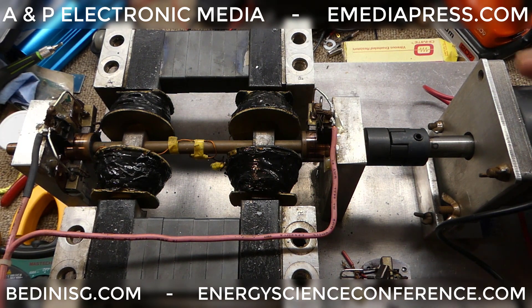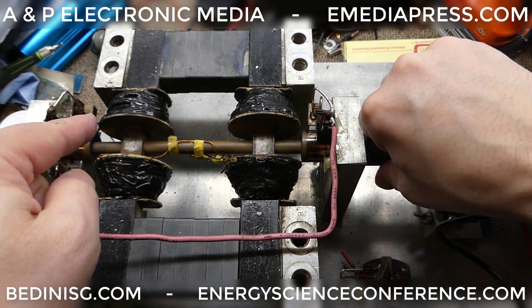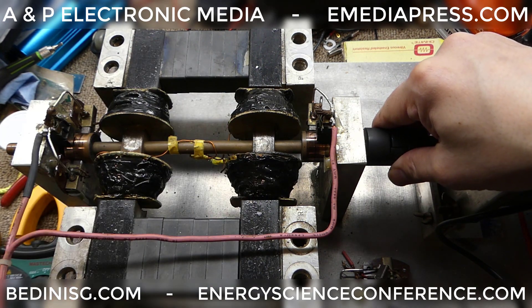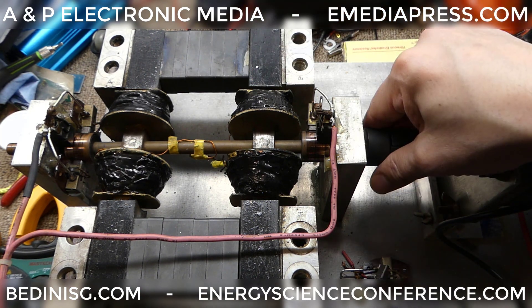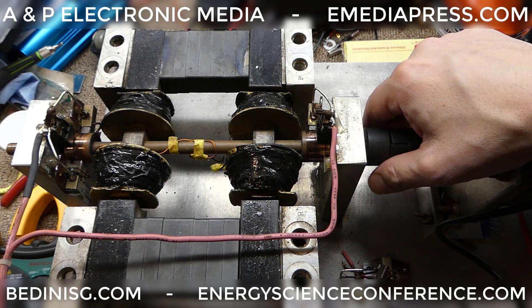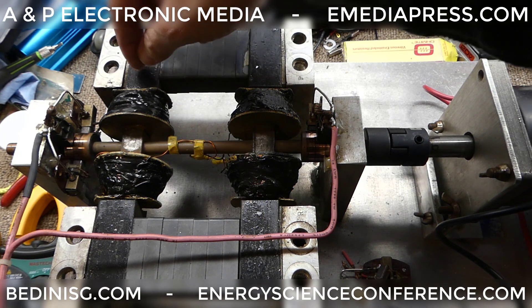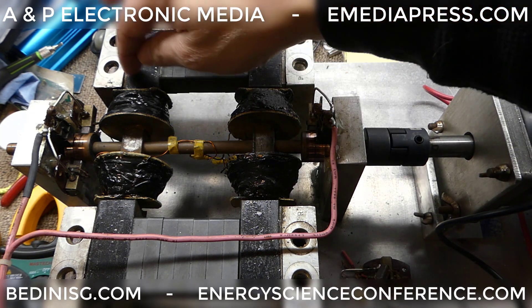One thing I wanted to walk through is John's build here. These are coned because if you had the full circumference at this end, when it comes here it's going to hit. He did it that way so he can have a pretty tight gap. These gaps are actually not highly accurate — they're a little bit tighter on this side than this side — but the point is you want the gaps to be as tight as possible. If you have coils with the same diameter all the way through, then you need a pole sticking out so the edge of the spool isn't going to clip your iron laminates.